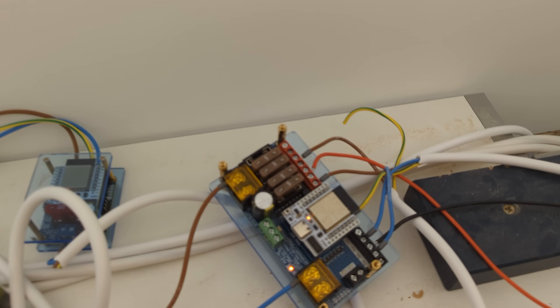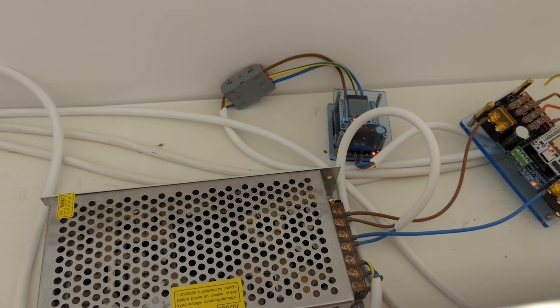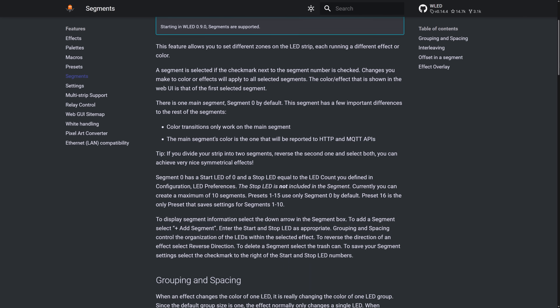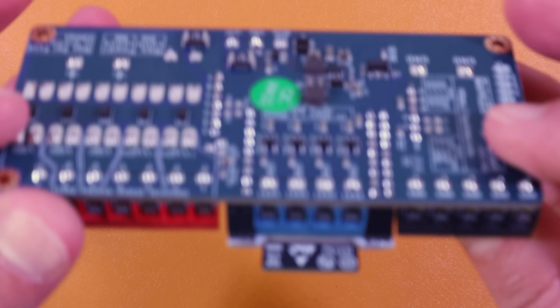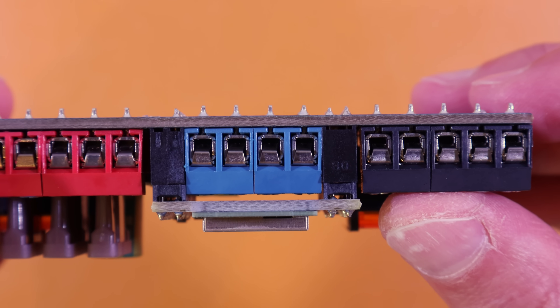One of the other mistakes I made when I initially set this up was using two WLED controllers — one to control the lights at the top of the cabinet and one to control the lights underneath. I always knew that both of these Quinled controllers supported multiple WLED channels, so I was aware that I could have theoretically connected these two sections into one controller and still used them independently. But at the time I wasn't smart enough to figure out how it worked, and since I had two controllers available I just used them both. My viewers pointed out how silly this was, so I took this as an opportunity to learn how WLED segments work. I should be able to wire up the lights at the top, the existing lights under the cabinets, and the new lights for the extractor fan into a single Quinled dig-quad controller which I already had sitting at the top of my kitchen cabinets.